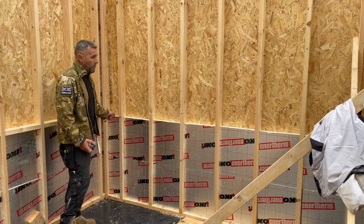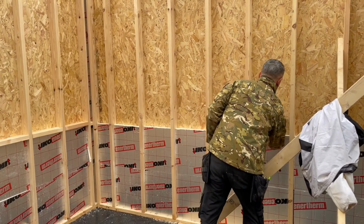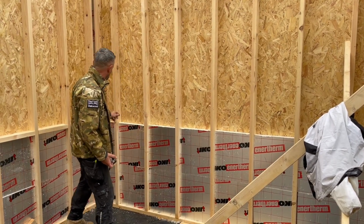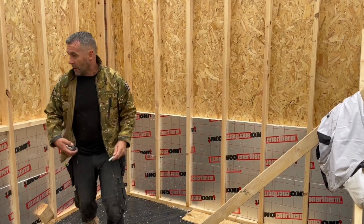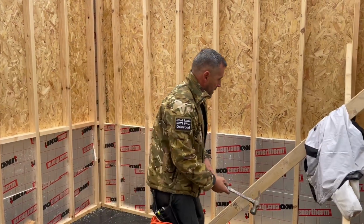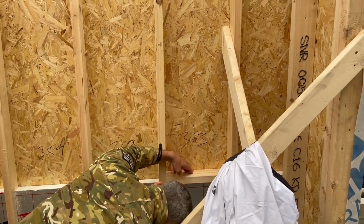But the last one I won't put in, because if he's made a couple of mil too big here or a little mil too less there, that's a 3, Adam. That's a 2. So if he's made it a bit big, bit small, whatever, it doesn't matter, because it'll still go in. But when you get to this last one, then you want to take a measurement off of that and get that one right. So he'll throw them in. Where are you starting, Adam? He'll literally go as quick as he can now, and I'll try and keep up to him, and he'll try and keep up to me.